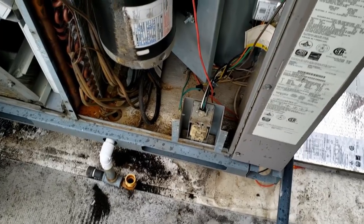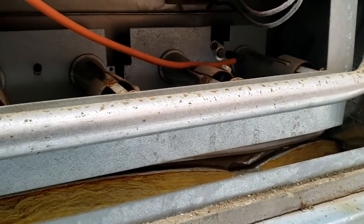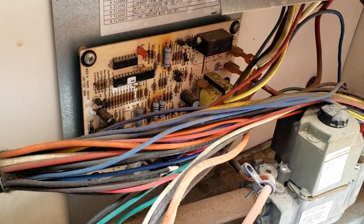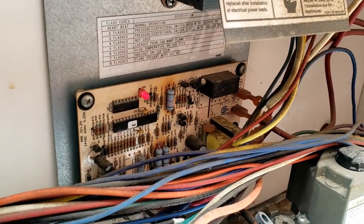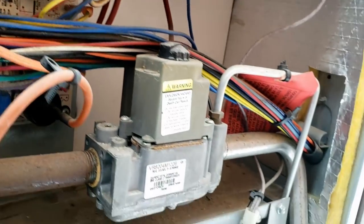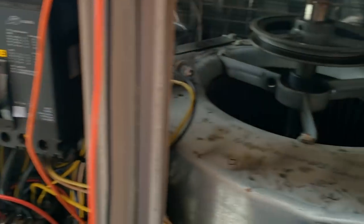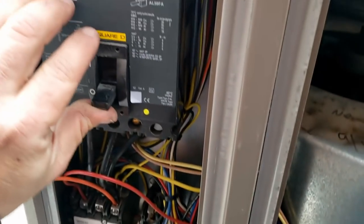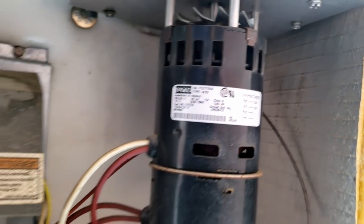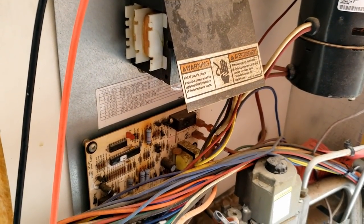It's starting to rain, which is always wonderful. Let's go ahead and see what's going on with this. I haven't heard an ignition spark yet. One, two, three, four, five, six — six flashes: high temperature switch open. Now that we don't get zapped, look at that — it turns off nice. Let's see if we can find this open switch. All right, the high temperature switch — you couldn't see it but it's right back there in the back. Got that pushed.